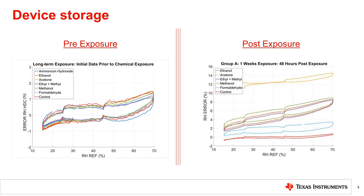Due to the open cavity style package required for humidity sensors, there are common IC storage tendencies that need to be avoided when storing or transporting humidity sensors. The most important is to avoid storing humidity sensors in an anti-static polyethylene bag or foam. This material emits gases that can affect the sensor's output. Similarly, we advise staying away from other adhesives inside storage containers for the same reason. Regardless of storage duration, we recommend using metallized anti-static sealable bags, as we have not seen these materials cause an adverse effect.